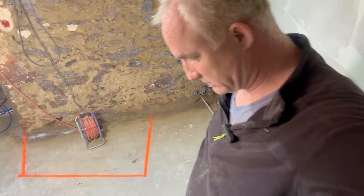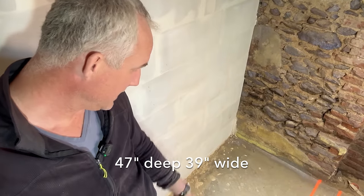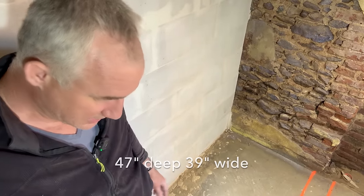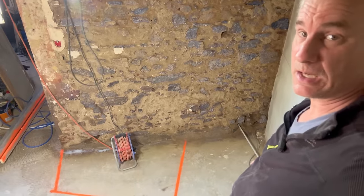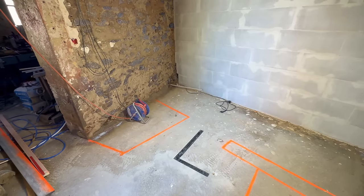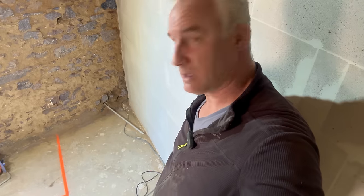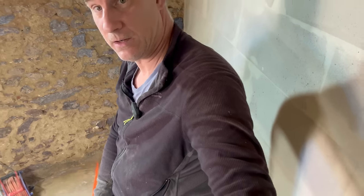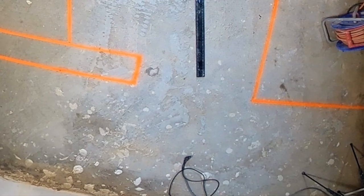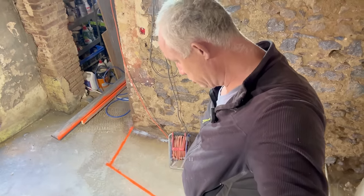Well, that's it. My dimensions, and I'm giving the dimensions in centimeters: for the shower, it is 120 centimeters deep and 90 centimeters wide. Then I have the same width for the toilet compartment, so to speak, that is 90 centimeters wide. It's sufficient. And then the passage between the shower's dividing wall and the vanity is 70 centimeters, which is sufficient, not huge, but sufficient.